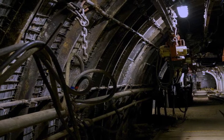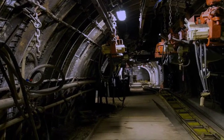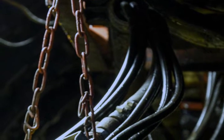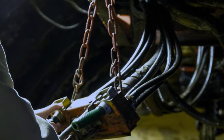Typical applications include use with mining equipment where a ground check conductor is required for ground monitoring — things like mine pumps, shuttle cars, and conveyors. Type G and Type GGC cable can also be used for heavy duty service as power supply cable where grounding is required.